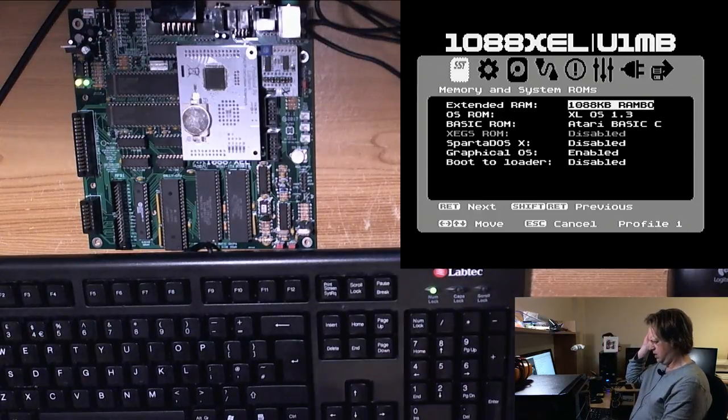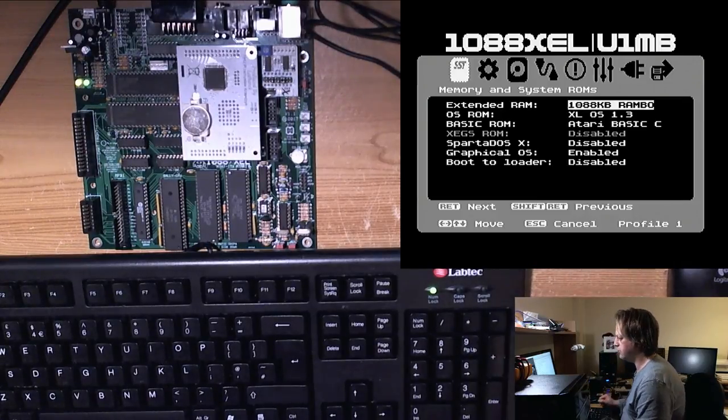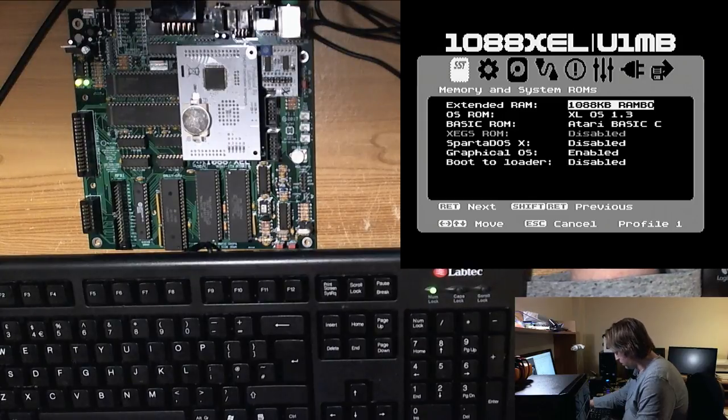I think it was last year's update. I spent a bit of time running the loader without any cartridge connected, because it's a complicated program and I wanted to make it survive unexpected situations. But the timeout is very long, I noticed, even though I reduced the timeout on the IDE driver when there's no card connected in the emulator, which is the only way I've been able to test it. The timeout at boot is still very long, and I'm assuming it's just repeatedly polling for various operations. It could probably make the timeout in the compact flash card even shorter. But if you're happy with how it works, that's the main thing. That's why I've left it brewing for so long, because I want some feedback on it, and I really do.